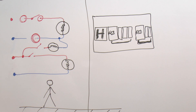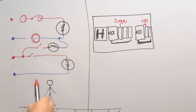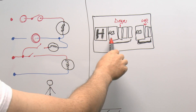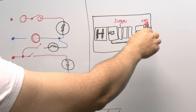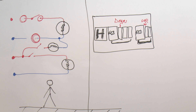This is not a configuration I particularly like or generally install, but there are plenty of these around. The problem with a shared neutral arrangement is that if you've got a circuit taking power from the downstairs and returning on the upstairs neutral, it simply won't work with two RCDs — because RCDs work on the current going out and coming back being exactly the same. With that cross-circuit arrangement, there's an imbalance and the usual result is that both RCDs trip, sometimes just one, but quite often both, as soon as somebody turns on the stairway light. If the stairway light is not turned on, all works perfectly fine and you wouldn't know there was a problem.